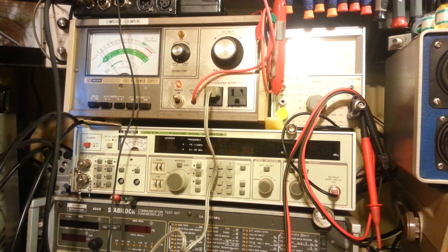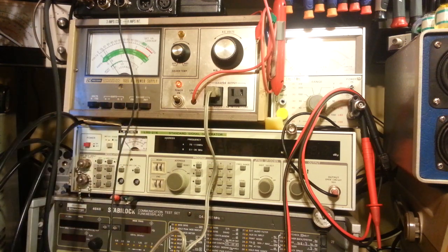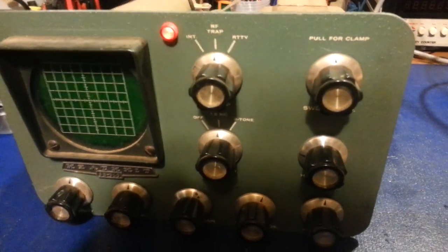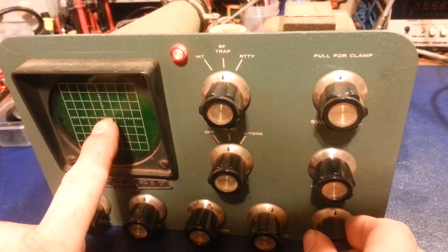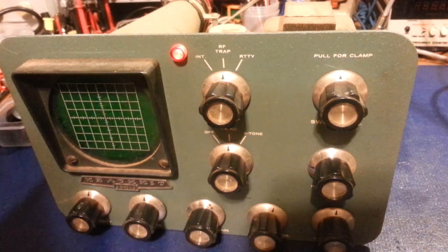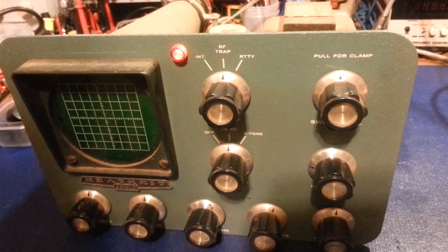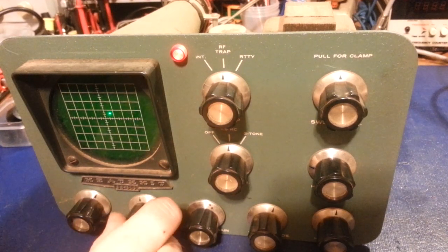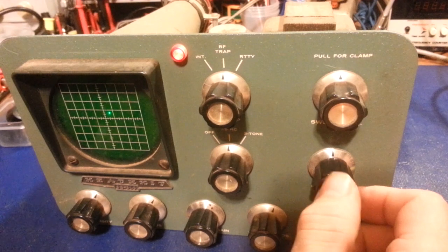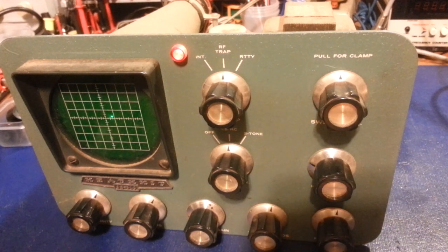I'll be darned — I see a dot on the screen and we're only at about 70 volts. I can really faintly see it — see that little guy right there. Moving it up and down and left and right. Bringing the voltage up some more. The capacitors are definitely reforming because the current drain has dropped dramatically. Lord knows how many decades it's probably been since they've had electricity going through them. There you can see the dot.